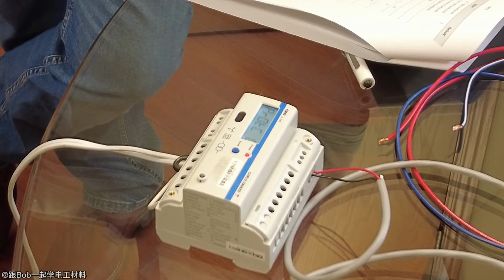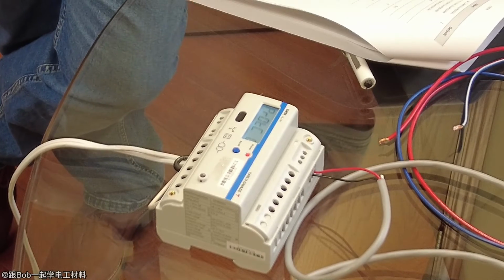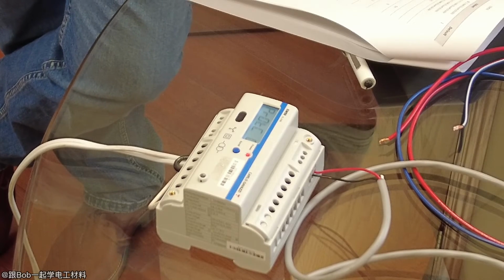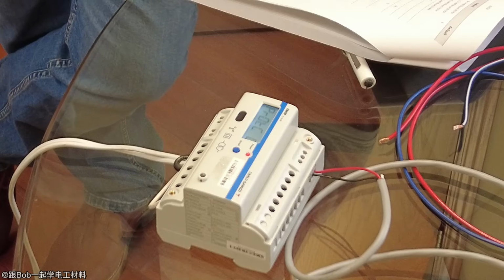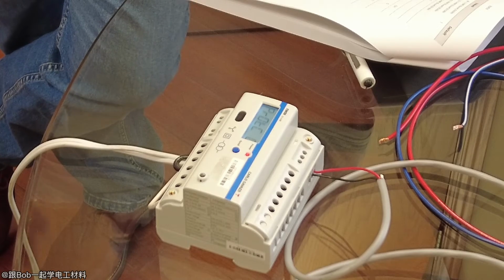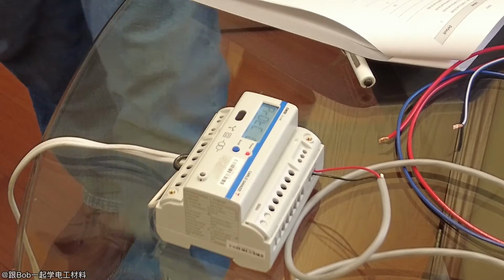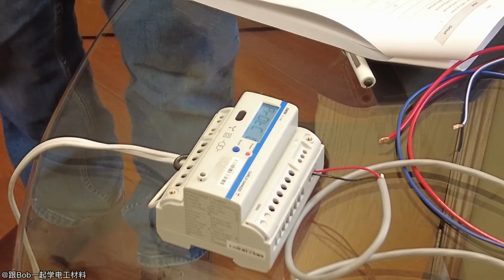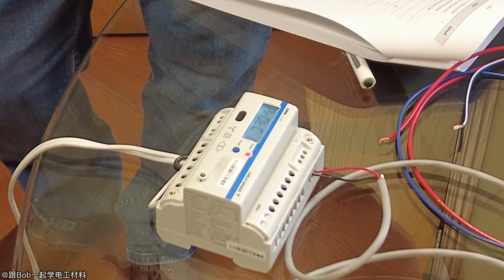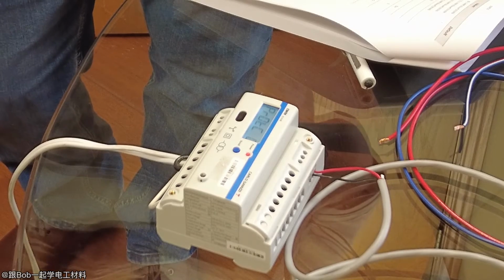So if you're going to use the wiring check, you turn it on, and it'll tell you which CT is backwards. Okay. When I'm doing jobs now, I don't bother with that because I can look at the kilowatt and I know exactly if the CT is backwards. If the kilowatt's negative, the CT is backward. Okay. So once you go into the field, he's got 3 of them up, and he says, "But the energy is not correct." You say, "Well, look at the kilowatt." You say, "Oh yeah, this one's 0." Or this one shows a negative value. That means the 2 leads on the CT, you just reverse them.